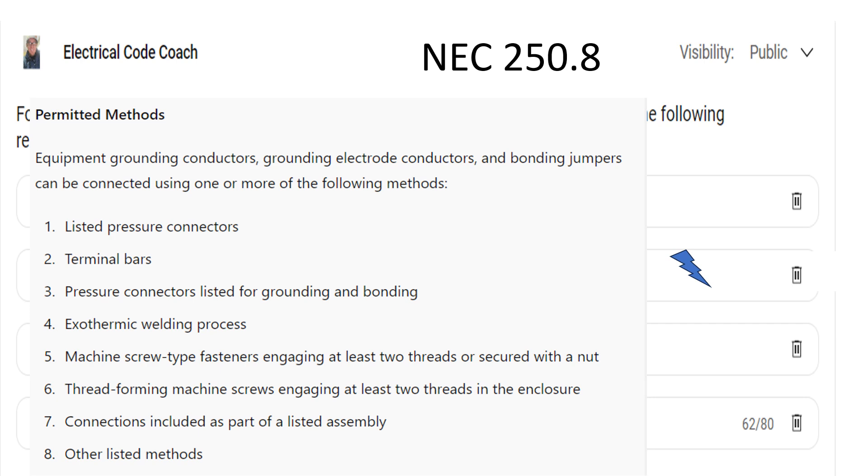When I'm bonding pools, if I'm bonding some metal — even if that metal is thick or thin — I will use a tapping tool and tap those 10-32 threads. I'll thread that screw in there, and then I'll still put a nut on the backside because of the serious nature of the necessity for equipotential bonding. That's a time that I'll use one or more.